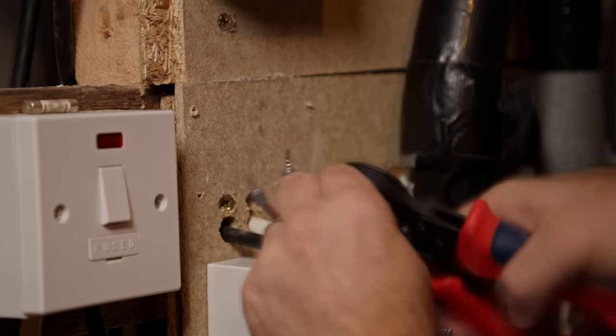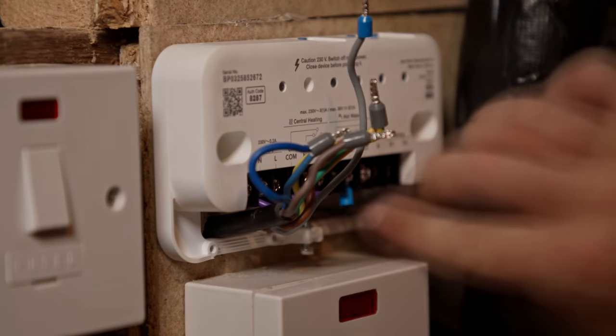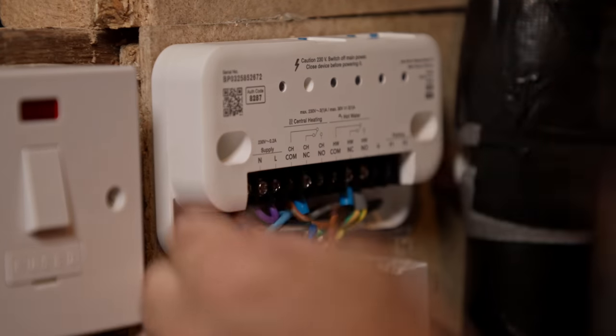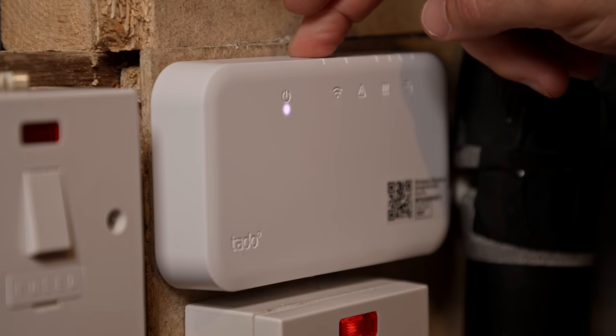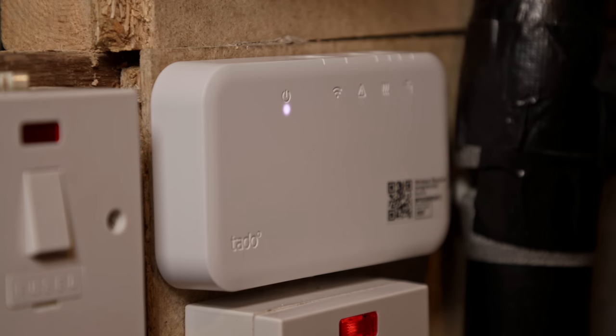It's a much better way of doing the wiring. You can see here that our bottom screw might be difficult to access because of the isolation switch below, but it's actually a hex fitting so I can do it up easily. Once the power's back on, hold down the binding button, and once that light goes solid and slowly flashes, we're nicely bound with our bridge downstairs.